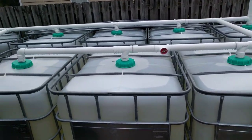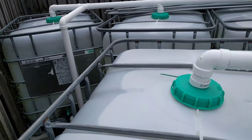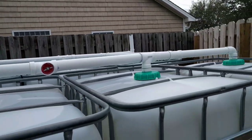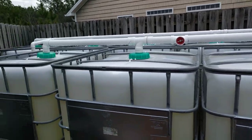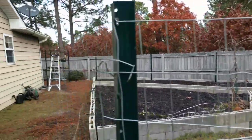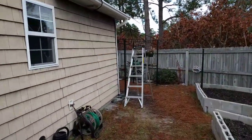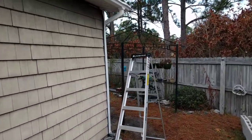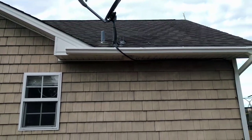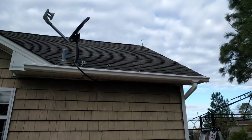Today I'm going to do a video about the top 10 tips for rainwater collection, especially if you're going to be doing something of a larger scale like this. The biggest tip would be planning — know the amount of water you need, know your roof square footage and how much water that means for collection. I looked up on Google Maps all the dimensions of my home, looked at the roof surface area, looked at all the places that I had gutters, drew out an entire map of the house, went on to city data and looked up the rainfall by month so I could calculate how much rain I could actually collect off the gutters every month.